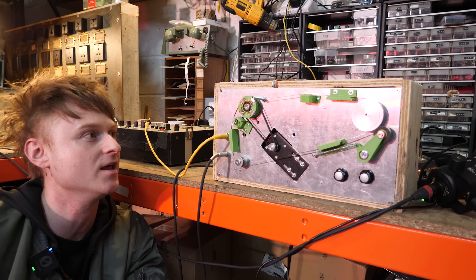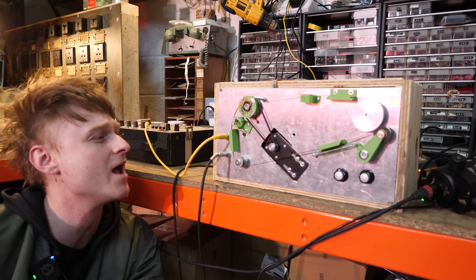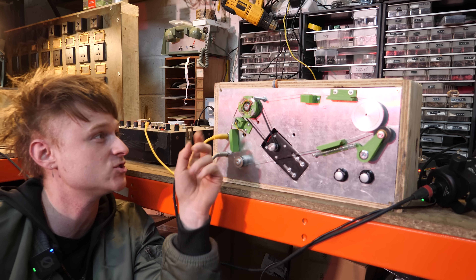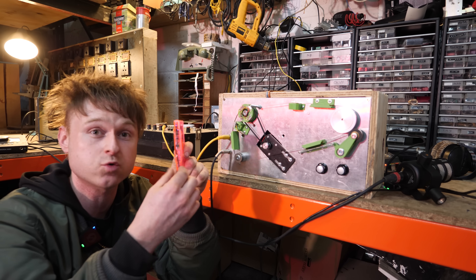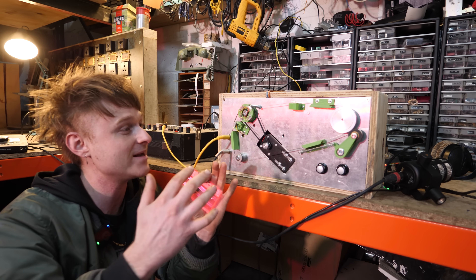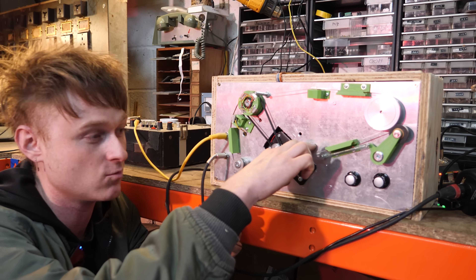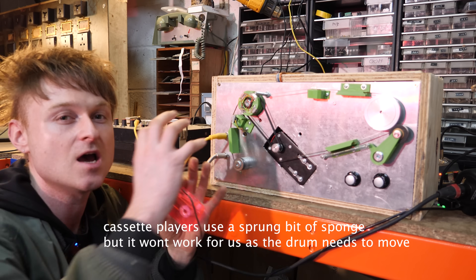So this version for this video is done. It's not perfect - in fact I've got a few modifications I'm going to be doing to it. I shouldn't have started by using cassette tape heads with one-eighth-inch tape from a tape cassette - that was a very bad idea. I should have gone for quarter-inch tape, which is twice as wide and is used for reel-to-reels. The tape is much more durable, easier to use, easier to make loops from, and when you put tension on it, it doesn't stretch. This stuff has been a nightmare because I can't put enough tension on it without literally stretching the tape.